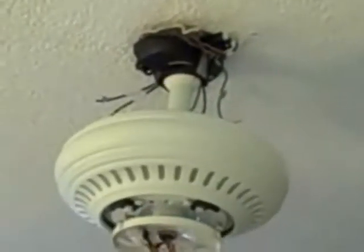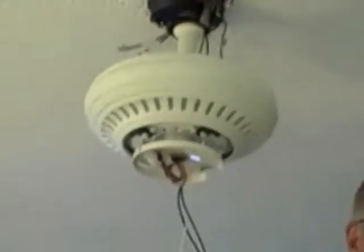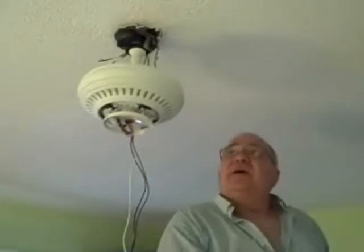This ground up here is a bare copper wire. Now I have to go get my wire strippers. We'll cut these down shorter and then go ahead and hook up — we're almost ready to hook up our electricity.